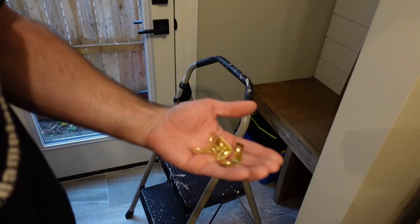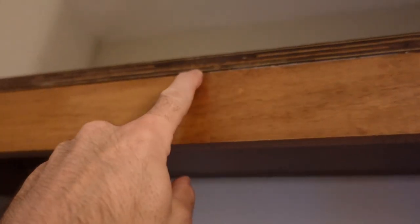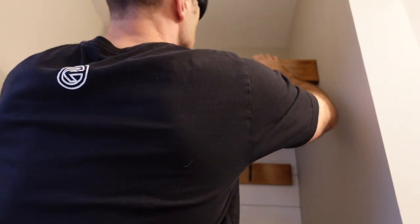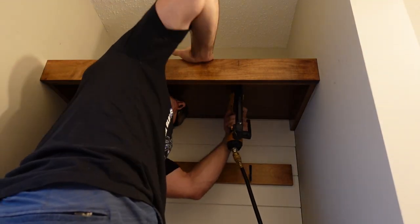I use angle brackets on the frontage again — one angle bracket on each of the sides, then two between that front support board and the plywood. That's what it looks like with a stained plywood edge — if you don't mind it, you wouldn't need the front board. But the front board looks better and gives a lot more support so the shelf won't flex down, particularly on a wider shelf. It gives you a double board up front. I use some glue, put that down, and shoot brad nails from the back forward.